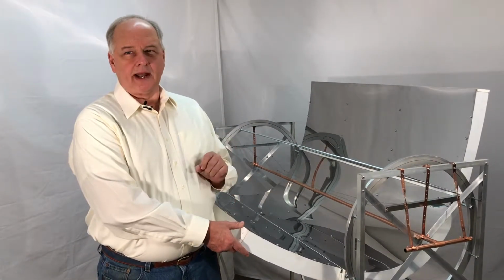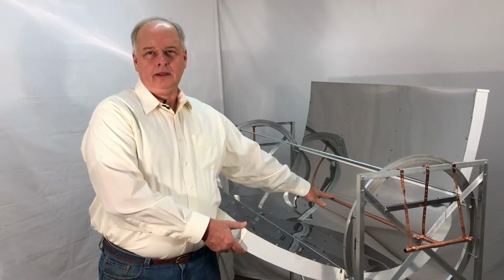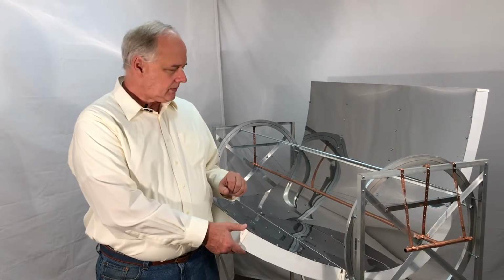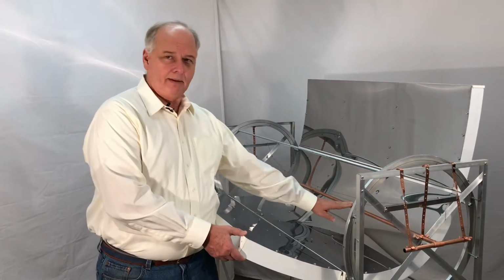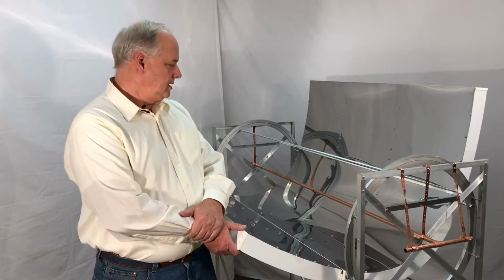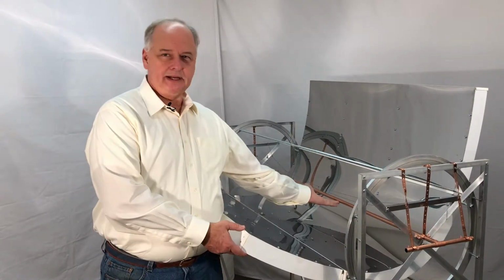The one I'm most excited about is a focal line desalination unit. Most seawater is desalinated by multi-stage flash evaporation. Seawater is preheated and placed in a focal line steam drum. The RingTrough adds the heat needed to flash the water into steam. Only the water turns to steam and the salt is left behind in the steam drum.